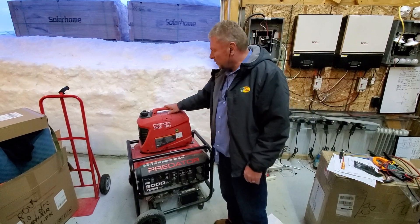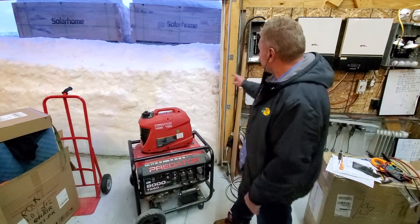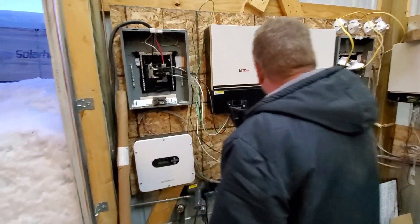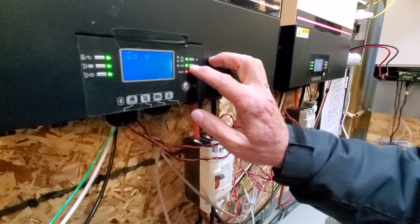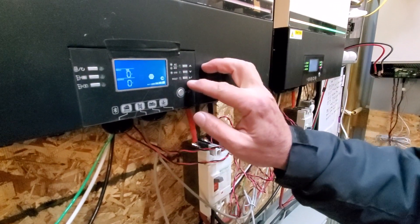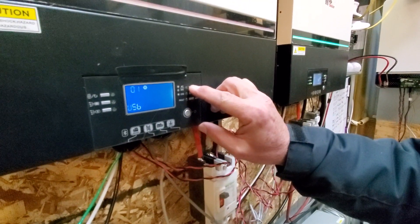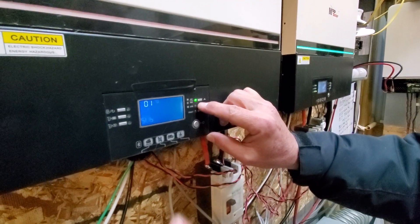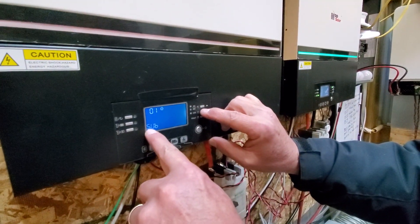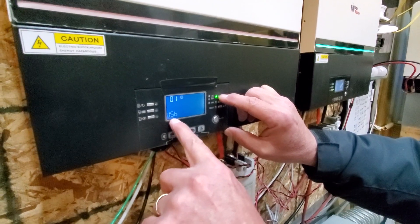That's a big 6.5 kW inverter and I get this question a lot: can I run a 1100-watt generator to charge this 13 kW system? Of course you can. All you do is set the utility charging amps appropriately. There are two settings. If you want to charge from the generator, the best way is to set utility as the first priority — that means utility, solar, then battery.